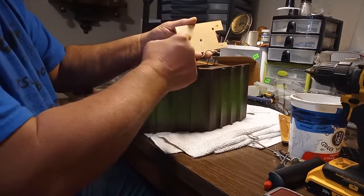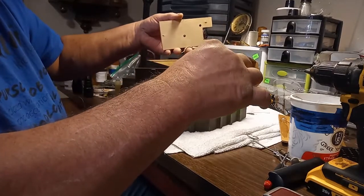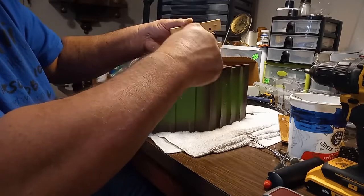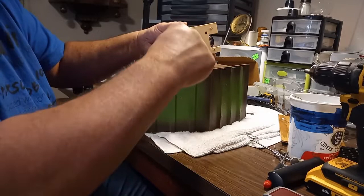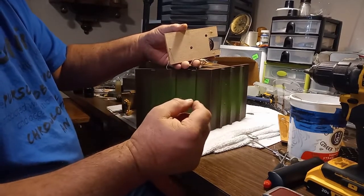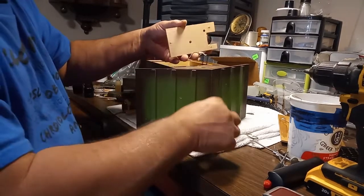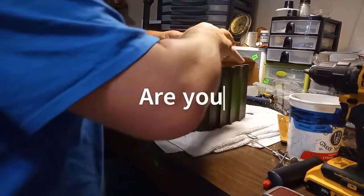There's the music box — forgot where I laid it. Stick the wire in the screw hole, and as you push the music box up, you're pushing it onto this wire until it comes up to the roof. Then you'll be able to take the wire out and put a screw in, and it lines up really well. Works out really well to do it this way.